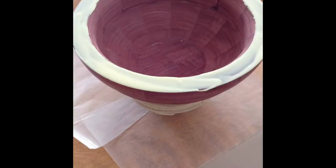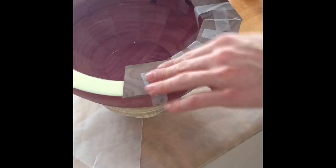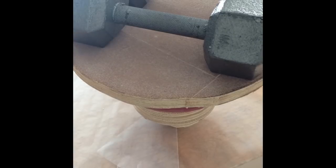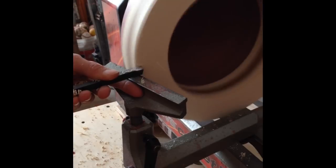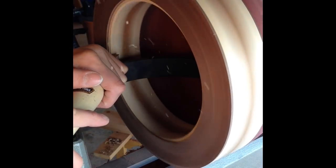Between the purple heart and the maple of the chevron pattern I want a bit of a transition. So I took some walnut veneer about an eighth of an inch and made a ring out of that, and I am going to put that between the maple and the purple heart on both top and bottom of the chevron pattern. Instead of clamps I am just using weights to clamp it. With the walnut ring all dry I can go ahead and glue the chevron pattern ring on. This ring I didn't get exactly centered so I would have to true it up a little longer, but it worked out well, especially since the maple is a lot softer than the purple heart.